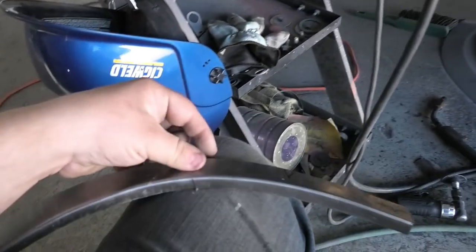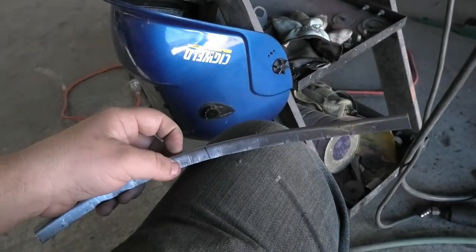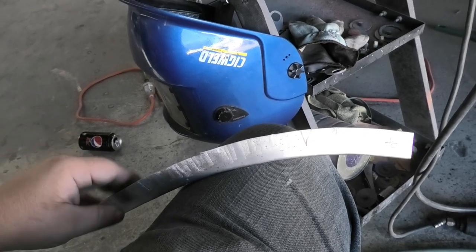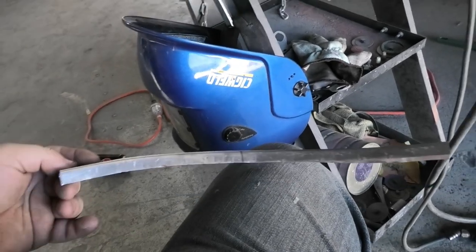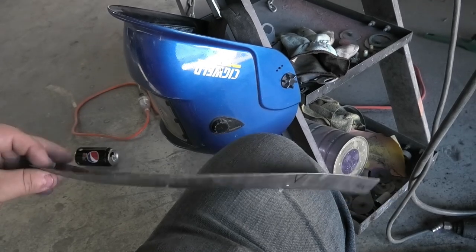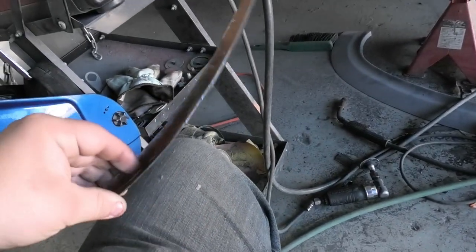One of the things you've got to watch out for, I will add, is when you're stretching it so you get that curve, and then you start putting the shrinks in here, it will start changing the top shape, so it does move around a little bit. You will have to work it backwards and forwards until you get it right. But you can make some pretty interesting shapes using that piece of equipment.